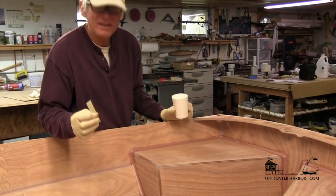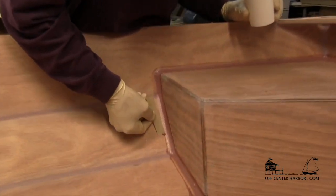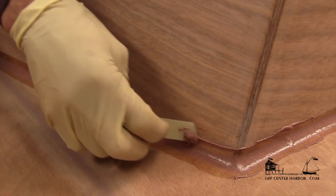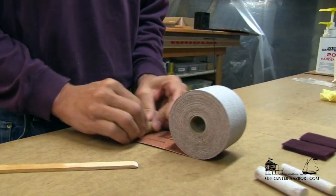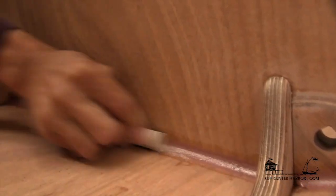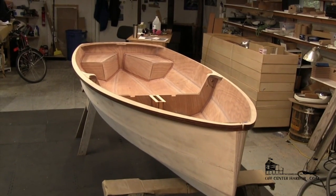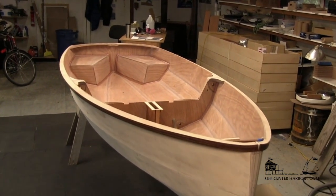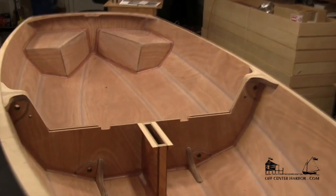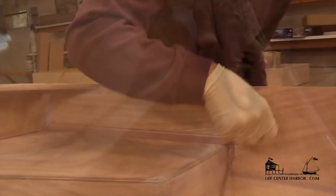You do have to fold over the burr a couple of times and keep getting the burr off to get a really sharp edge. These are the kind of fillets where the cleanup with the chisel stick goes really fast — it's just dead easy. You're just running both edges of the fillet all the way around. We use various different sanding tools to sand fillets and to prep areas before fillets. The only way to really get them is with something that kind of mimics the radius of the fillet. If you have the right technique, they can come out really clean and not require much sanding to look good.